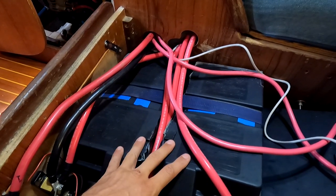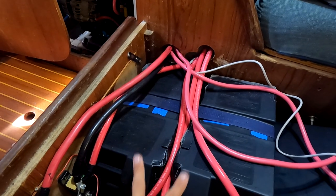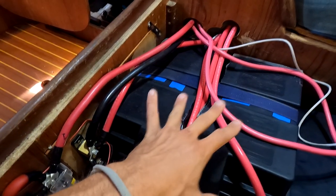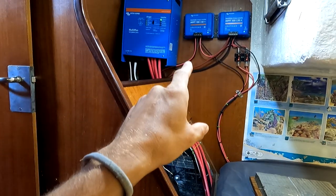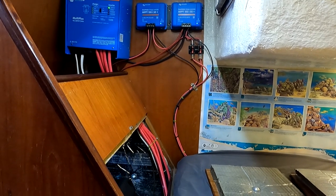But you still need to capture a large amount of electricity for when the sun isn't shining. So from this bus the cables run back out and go towards my batteries. Any extra electricity not being used by the boat comes through these cables and down into my batteries to be stored. I have two different battery banks, each with a capacity of 280 amp hours at 12 volts — both lithium iron phosphate batteries with a battery management system attached. Between these batteries and those charge controllers, we have even, continuous power throughout the boat both when the sun is shining and when it isn't.